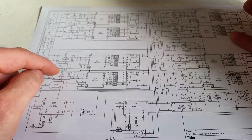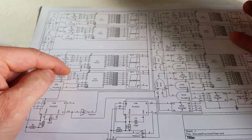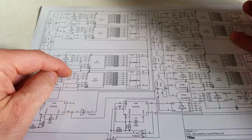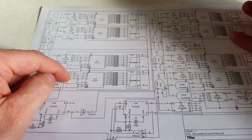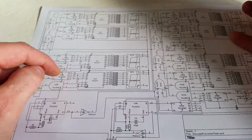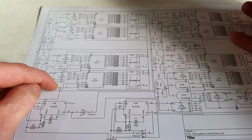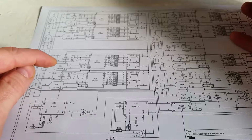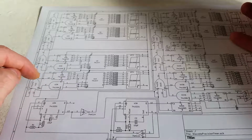So in order to make it roll over when it gets to 9 back to 0, I'm using an AND gate here, and I'm taking it off of the counter lines, so that they have values of 1, 2, 4, and 8. I'm taking from 2 and 8, which add together to make 10. So when the count gets to 10, it goes through the AND gate, and it goes through an OR gate, and I'll come back to the other input of the OR gate. One of the inputs of the OR gate is this, when it gets to 10, and it goes into the reset of the counter. So the counter will just count from 0 to 9 and then back to 0 again. But there's another thing which happens on that reset.